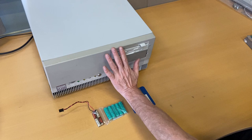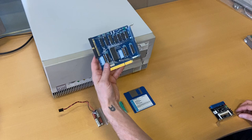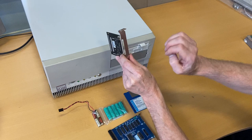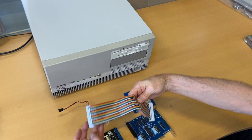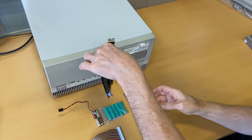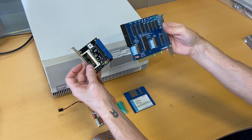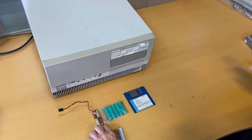The other task is that we're not having a hard disk anymore — the hard disk was completely dead as you saw in the previous video. So we are putting in an XT IDE, which is an 8-bit controller card that emulates a hard disk via a CF card. It comes with a cable connecting the two parts, and they go into two slots. I already used the combined single-card versions in other projects, so I'm left with this two-card setup.